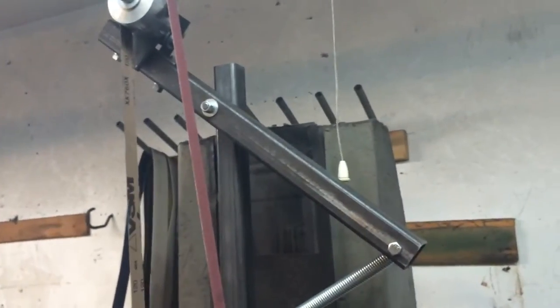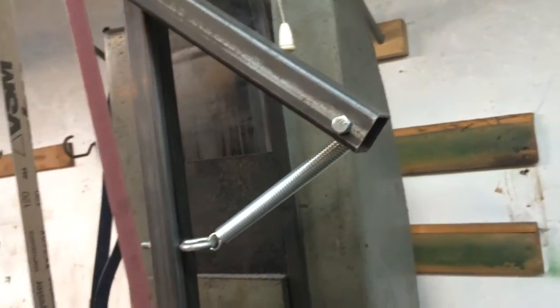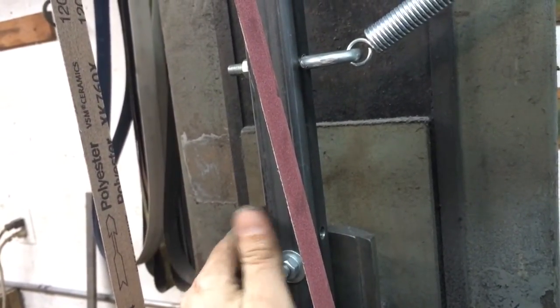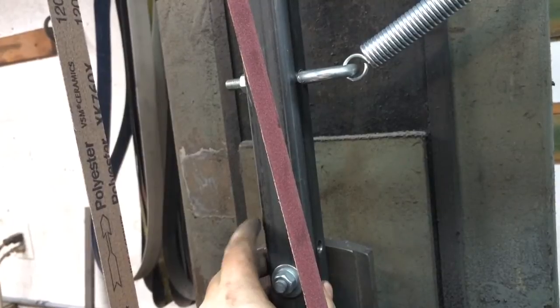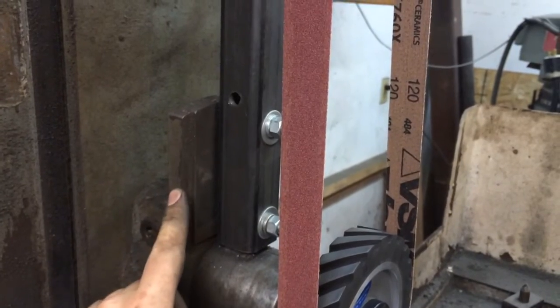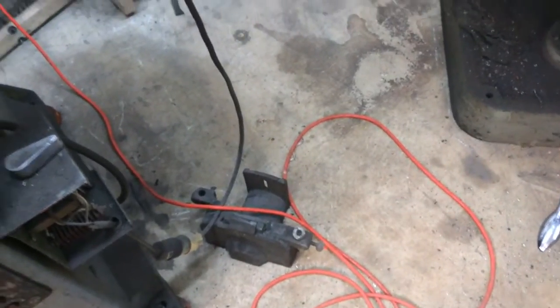The rest of the assembly is made from inch and a half square tube. The upright is 3/16ths thick wall and the tracking arm is only 1/8th inch thick. I wanted something solid and stable — probably could have gotten away with 1/8ths all around, but I went with 3/16ths for a little extra mass and rigidity. I mounted it to an existing piece on my machine where the dust shroud originally mounted, using the existing bolt holes with some 3/8 inch bolts.